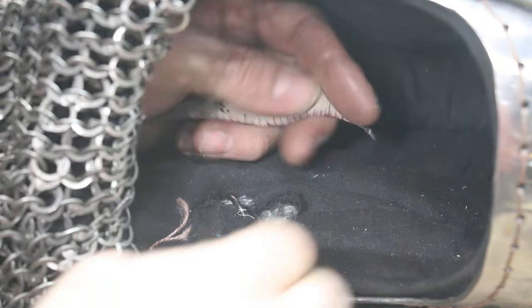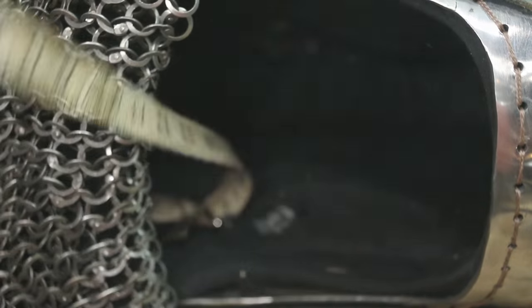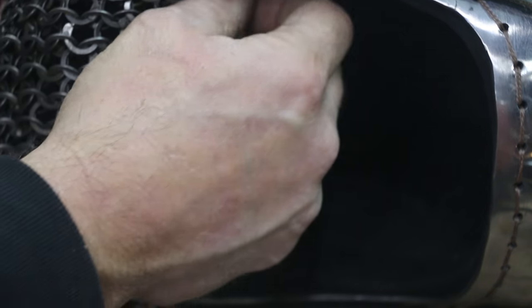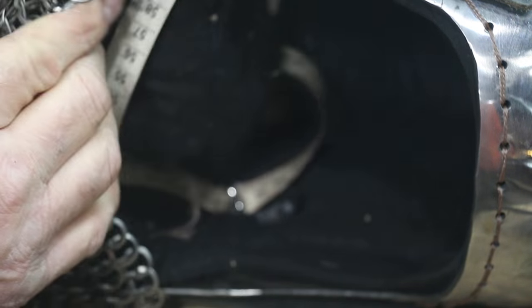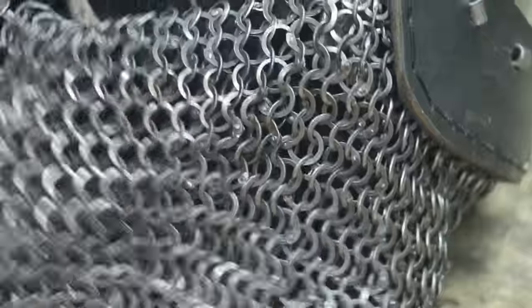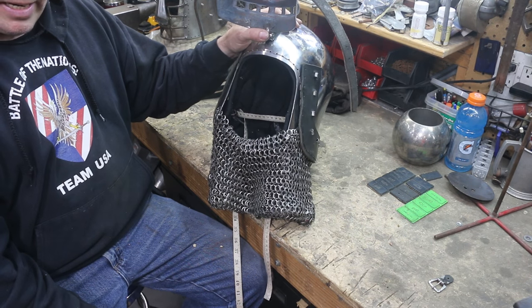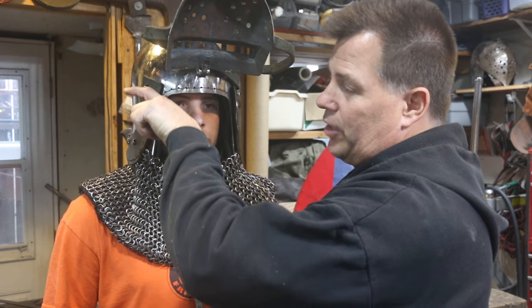What we're going to do is take a tape measure and feed it through this D-ring, then go to the other side of the helmet and feed the tape measure through that side as well. We're trying to figure out the dimensions in order to build the chin strap to fit him in this helmet. This is kind of a personalized fit — it's going to change based on everybody's size, and it doesn't take too long to make it yourself. So we've got the two ends of the tape measure sticking down from the helmet. The tape measure is run up into the D-ring, down, around, over to the other D-ring, and then back down.